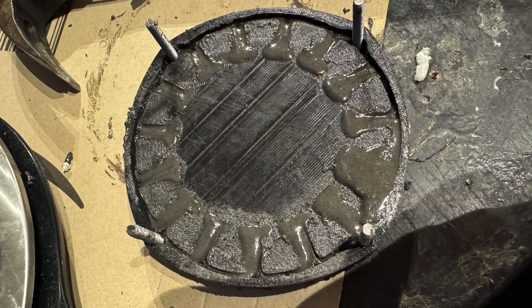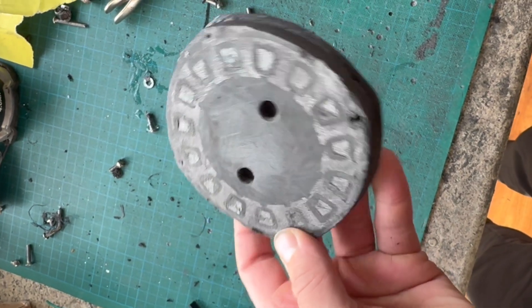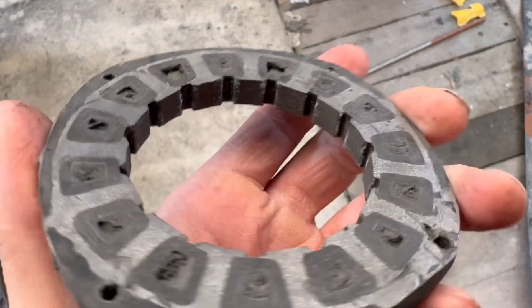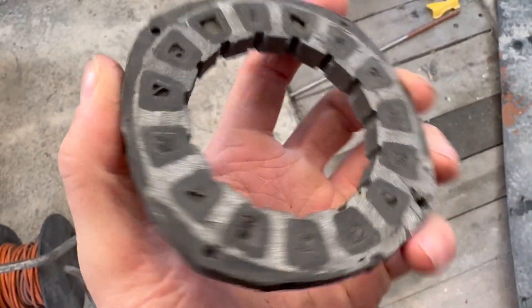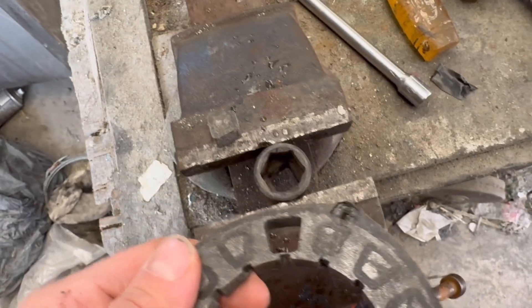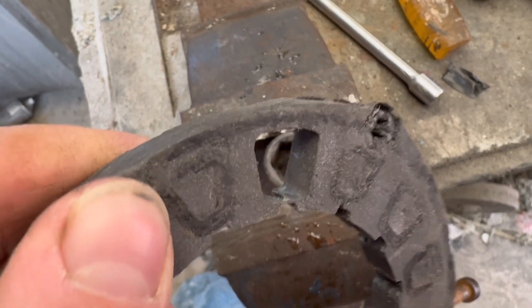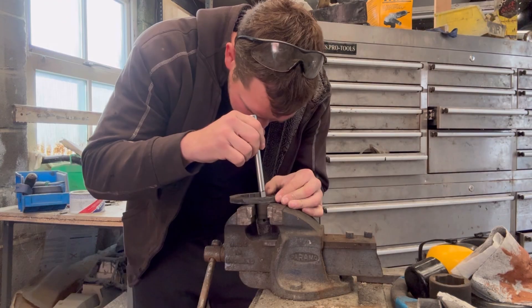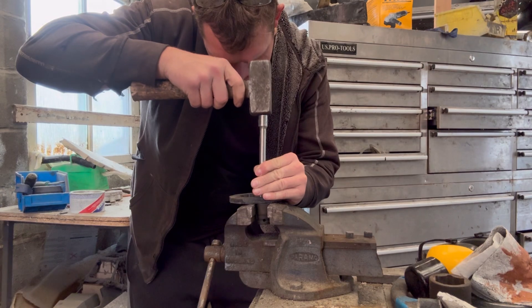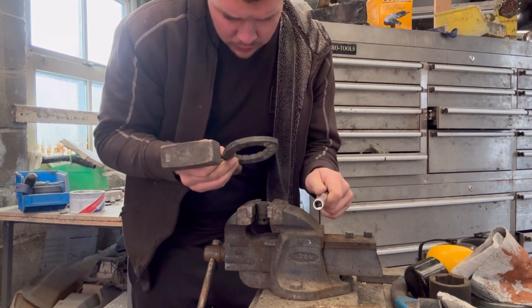It was just a case of pressing the iron paste into all the gaps, starting with the corners to make sure there were no air bubbles, and doing it until it basically overflowed. When it was dry I ground off the excess over the top to get it ready for demolding. The top and bottom came off really easily, and so did the center. There was some finesse needed to get the little side pieces out without breaking any slots. The SMC with those rebar prongs turned out to be stronger than I thought, but I still used a socket set up in the vice and knocked it through with a punch and hammer very carefully. Yes, this took way too long - there's certainly refinement needed in the manufacturing, but at least it worked.